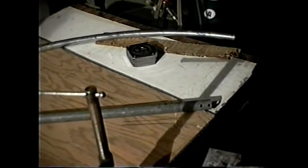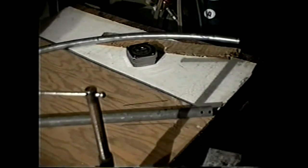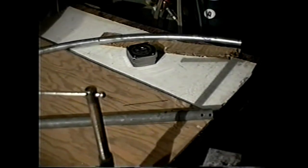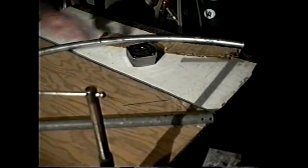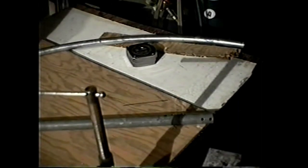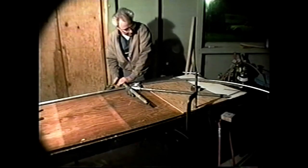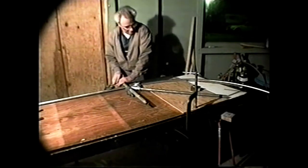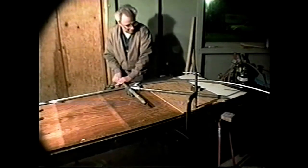It's a very simple procedure. It's even worthwhile doing on the guards that require half-inch conduit. Remember, this should be kept flat to the surface so that the bends are in a single plane. Half-inch conduit can be bent up over your knee merely by drawing a pattern on the floor and bending the tubing until it aligns with the pattern.